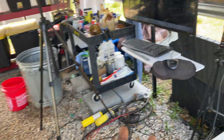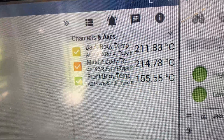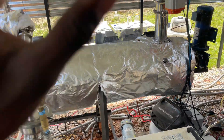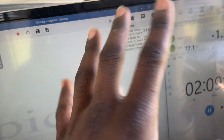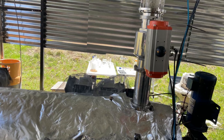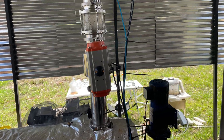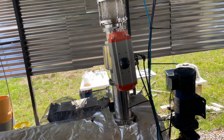Let's take a look at the temperatures. We can see the machine is operating very hot. I want to remind everybody that these temperatures are merely the external body temperatures — the probe is on the belly on the outside of the machine — while microwaves are actually heating up the plastic within on the inside. So the actual surface level temperature of the plastic is much, much higher than what we see. This is about what an average oven works at, and we want the whole body to be ambiently hot because as new plastic is loaded in, it allows that new plastic to absorb more microwaves. Hotter things absorb microwaves better and helps the plastic break down quicker into carbon. Carbon absorbs microwaves and creates a ton of thermal energy and infrared energy, and that helps break down more plastic — it becomes a self-feeding cycle.